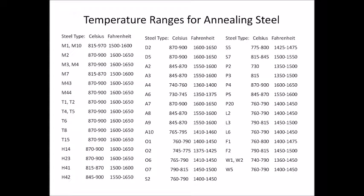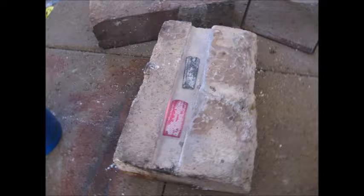There's no way that I can list the critical temperatures for every possible alloy here, so I won't. If you want to know a specific temp for a specific alloy, it's time to talk to the people who you got your metal from, or check the internet. Usually, we're looking for a color in the red range. Be wary of a bright red color — you're getting close to overheating your metal. If you get to orange, and especially if you start throwing sparks, you're past the mark and need to let the metal cool and start over.